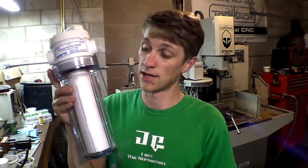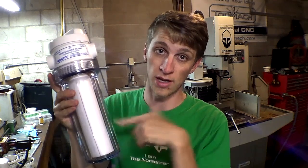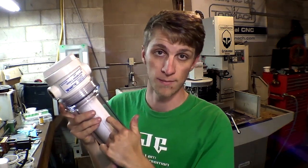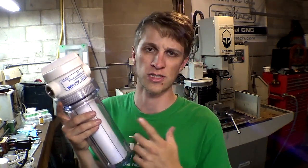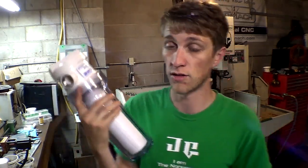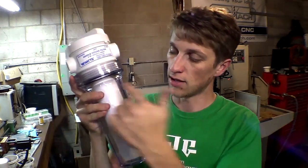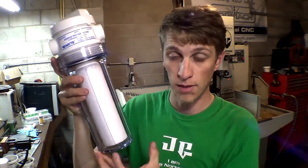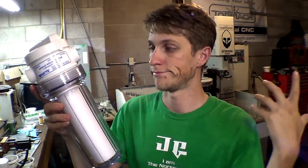This bad boy is $43 from Home Depot and it comes with three filters — one installed and two spares. You can get the filters in all different micron ranges; these happen to be 50 micron. A lot of guys on the forum were suggesting 200 micron or 100 micron as plenty fine. The ones at Home Depot are more like five and one micron, which might be too restrictive for a machine with dirty coolant. I love the clear container because chips will accumulate on the outside and you can see them.